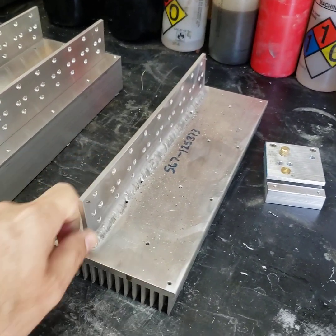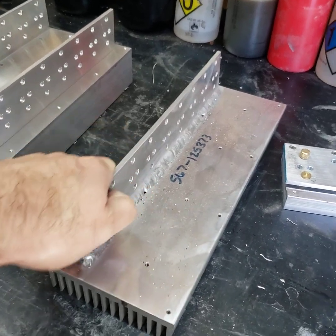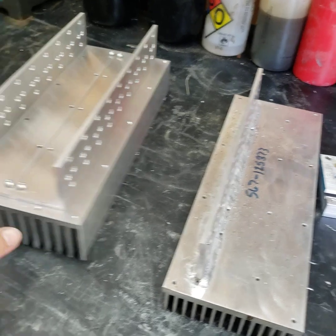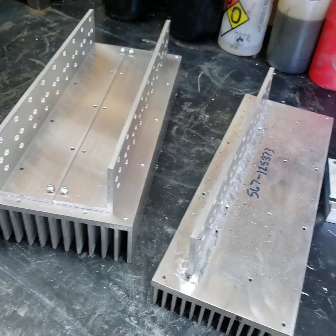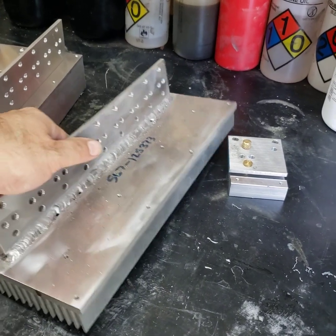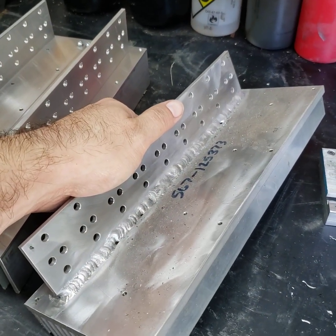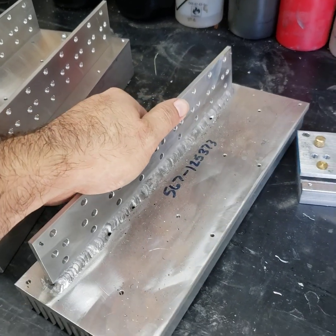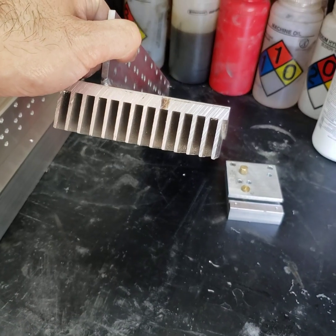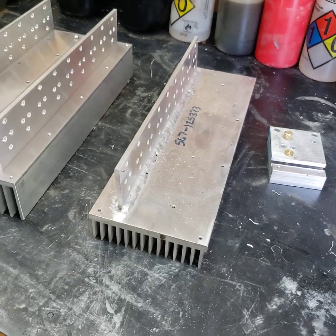I did this because I wanted intimate contact between the two pieces of aluminum, and sure enough they've got intimate contact. This was a cheap version because the angle pieces get kind of pricey. We were trying to cut some corners and play with our new welding toy, and we imagined it would come out nicer than it actually did. It'll work, but my weld is kind of drifting all over the place and it looks bad because I'm learning. I haven't taken a welding class yet, but I'm going to keep practicing — just not on something three-eighths of an inch thick on a hobby-level welding machine. It's a good machine, but I'm a bad welder, so those two don't mix very well.